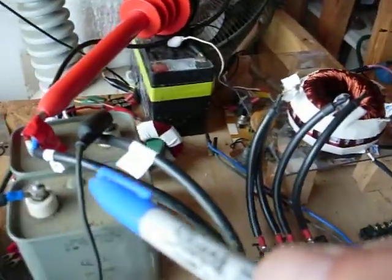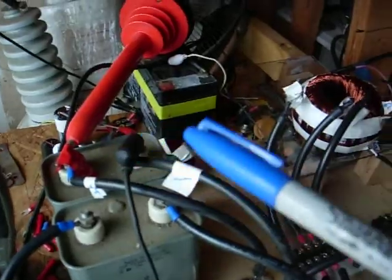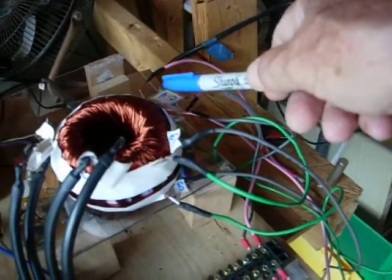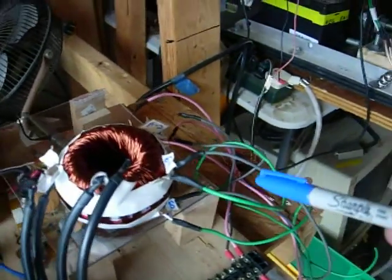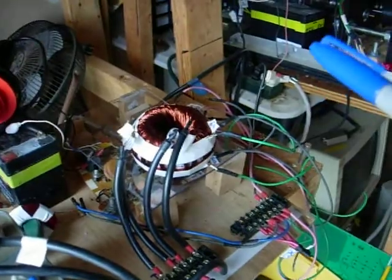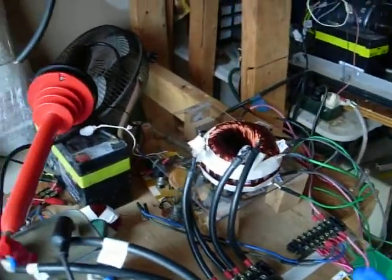It takes a while to get to 4,000, but to get to 2,000 it screams pretty fast. And that's only driving one — I'm only driving the A side of the coil over here. The 60 turns of the 17 gauge are putting out about 28 to 30 volt spikes — the mean reading is about 28 to 30 volts. And that's where we are today.